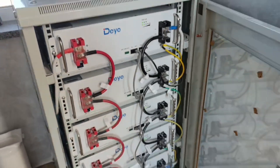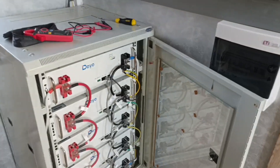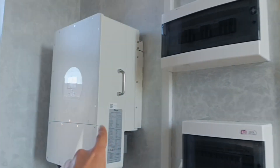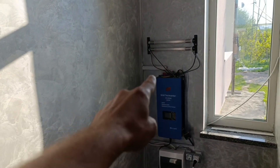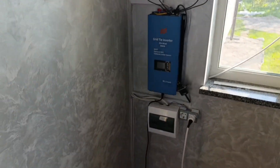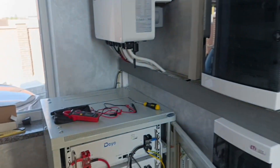However, the trouble is that these batteries will not fulfill my needs fully. As I mentioned, I bought a separate battery pack for 62 kilowatt hours — not 25 like here — and I'll actually be mounting an additional hybrid inverter like this one. They will both work in parallel. It will sit here, and down below will be that storage of batteries. I will move this wind turbine grid-tie inverter to another place — it will be sitting on a different wind turbine.